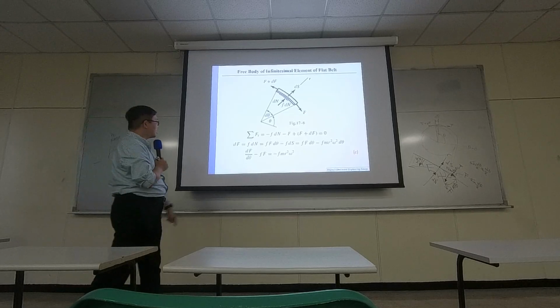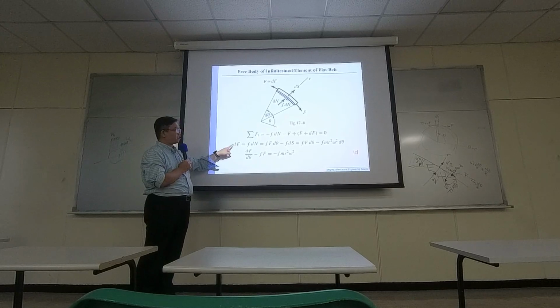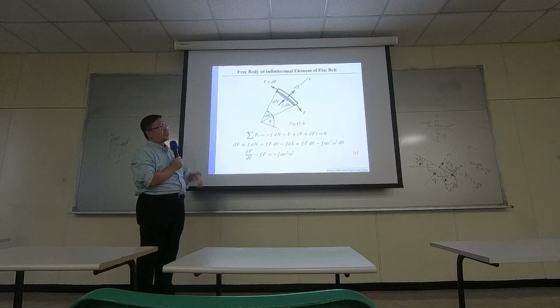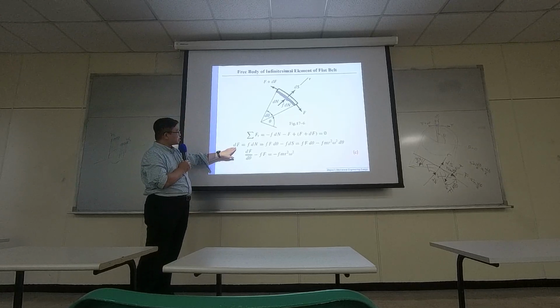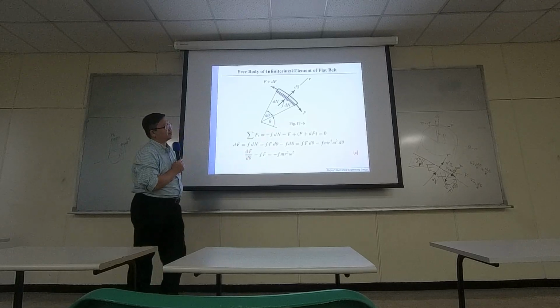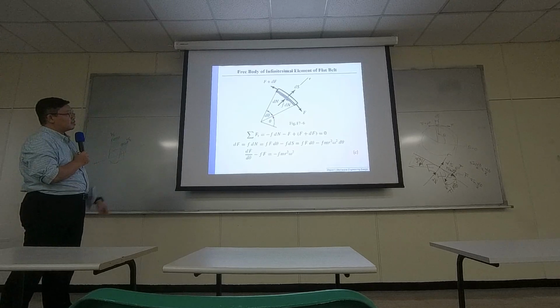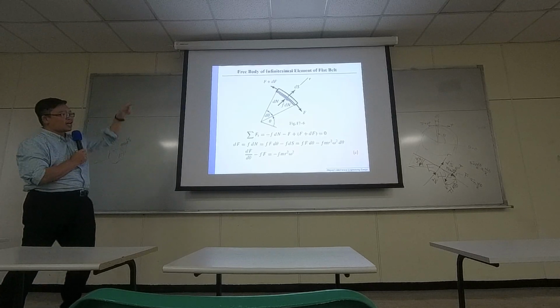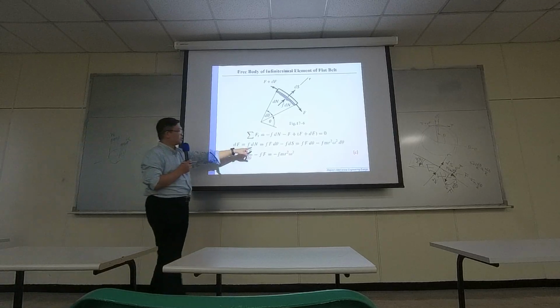Okay, so this gives you an equation for the increment df of the f. So df is shown in the balance of the transverse forces. So df now equals mu dn, with mu the friction coefficient. Okay, and from the last equation, we already know what dn is. dn equals f d theta minus ds. So you can plug it in.